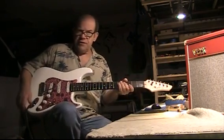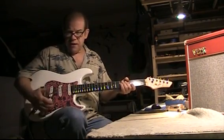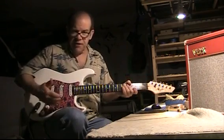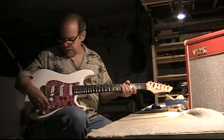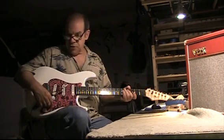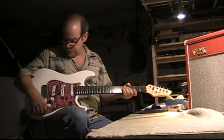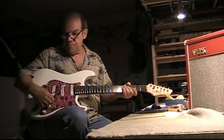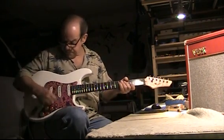It's the first time I've done this to a guitar, actually combining the GFS Clapton May board with these premium pickups, which has jacked the price up because of the parts that have gone into this guitar. The Clapton mid boost is here as tone 1, and tone 2 is the Brian May treble boost. And this is a great board from GFS. I've installed a low impedance volume to keep the signal low impedance out of the guitar.